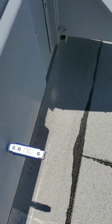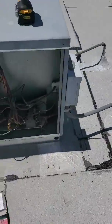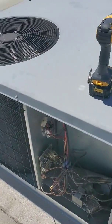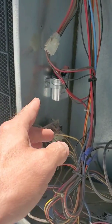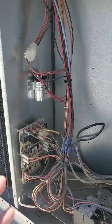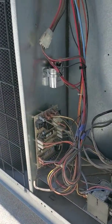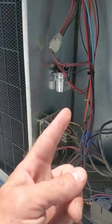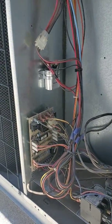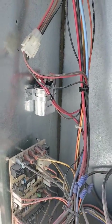59 degrees supply — we're looking pretty good. So the main thing: if your condenser fan is not running, you may want to check your dual cap or run capacitor, because that's what controls your condenser fan. If your indoor blower wasn't running and your suction pressure was really low with head pressure around 300, then you might want to check that fan's cap too — it might be a five or seven and a half microfarad. Just look and change like-for-like.